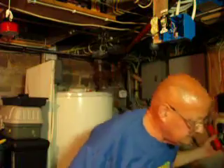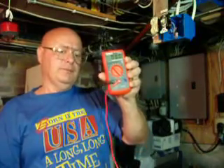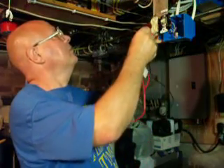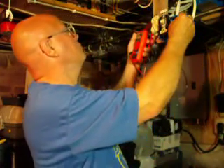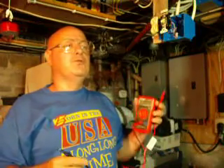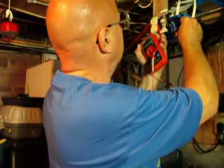We're back after going down in the cellar and turning on the breaker. This is a meter here, and we use 120 volts. We'll check from the white wire to the black — we have 120. From the red on the switch, we have 120. Now we're going to put this up on 300 volts, because this is a shared neutral box and both circuits have to be on opposite legs of the 240. So I'm going to show you that we have 240 volts — going on the black here and the red here, and we have 240 volts.